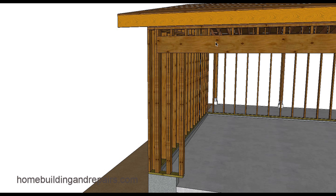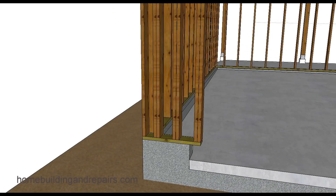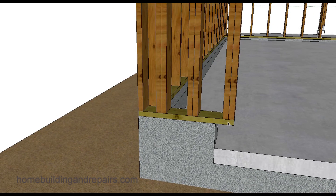Keep in mind this isn't going to be a fix for everything. If you have a beam that is maxed out on load from an engineering standpoint — say the load is maxed out at 16 feet — then you might not be able to move it. By shifting the trimmers over six inches, you're transferring the load down that area, and there's nothing to support it, so you might actually need to go to a larger header.